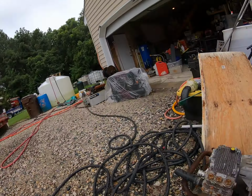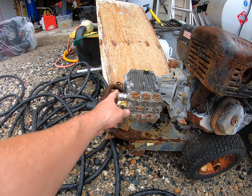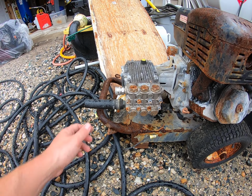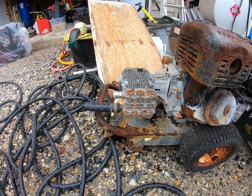Perfectly honest, when we set up the new 8 gallon a minute gear drive, the guys hadn't gotten the air out of the line yet, and therefore could not get the water into it. So that was a problem. Just one other thing on here, this one does not have its unloader on it. We actually quick connect a lot of the unloaders, or at least we'll leave them like the other ones. We'll leave them on there until the first time they fail, and then we'll put quick connects here so we can swap them out quicker, be able to make the whole swap in just a few seconds here.